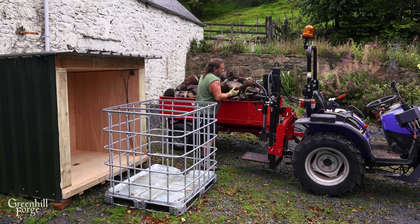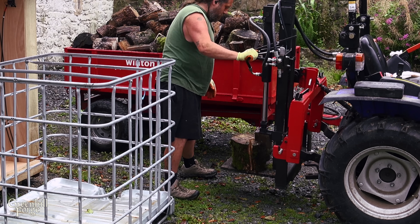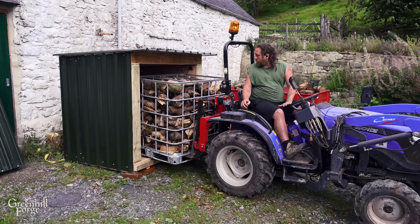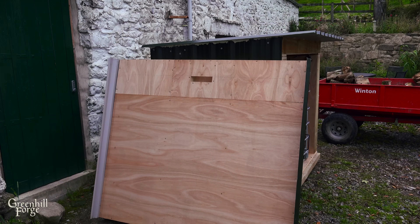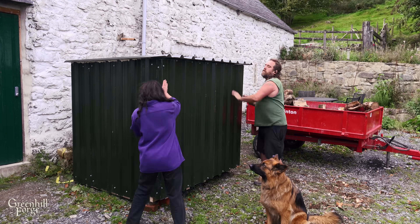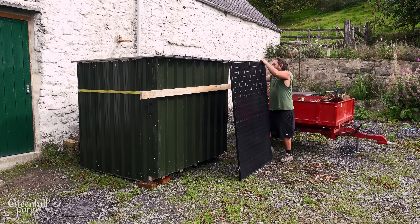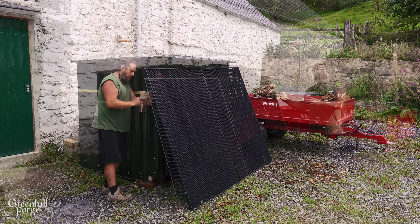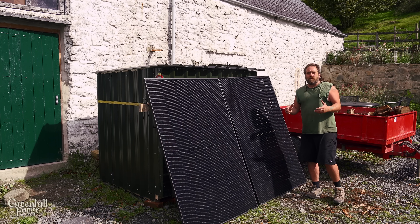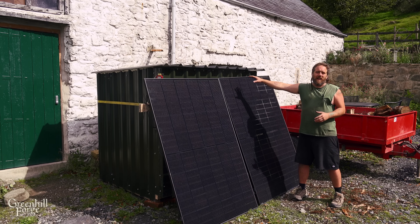Now I'll split a load of green oak to fill up the cage — I'll be using a log splitter that I made and I'll link that video in the description below. Now I'll put the cage into the kiln and then put the door on the front. You can see there's a vent hole at the top. The door is built in the same manner as the kiln and the siding is placed so that the ridges line up and it holds itself in place. Now I'll hook up the solar panels. The panels are hooked up and the heater is running. I've also plugged in the solar fan so it's running too. I'm going to spend a few weeks experimenting with different fan speeds and how hot I can actually get it inside.